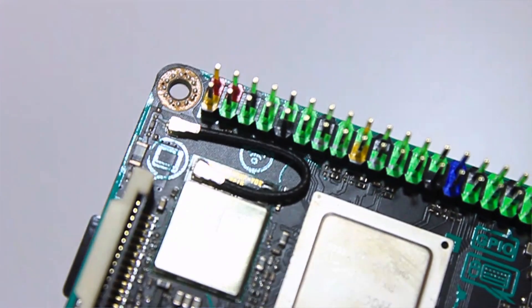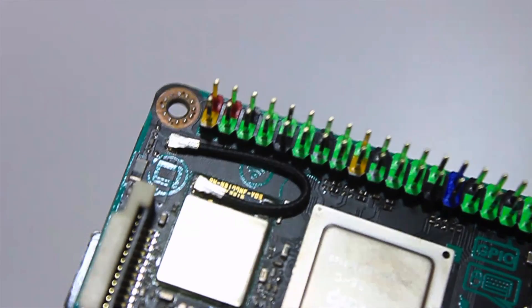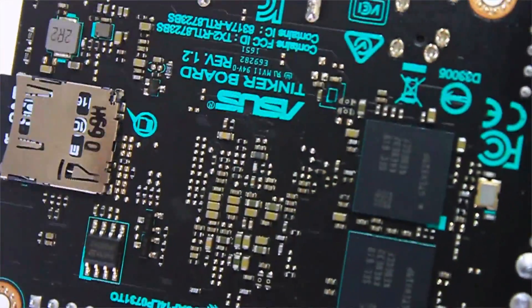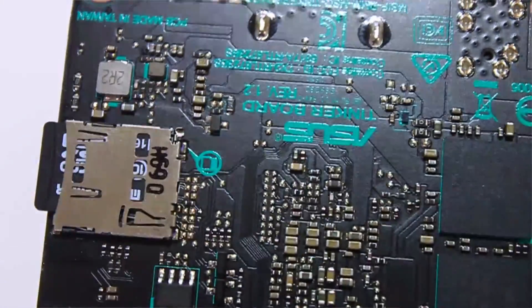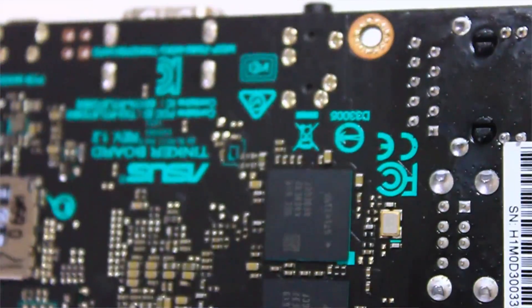Another thing is that they added an external Wi-Fi antenna connector so you could plug in your own to get better range. This uses a quad-core 1.8GHz ARM A17 processor with 2GB of DDR3 RAM dual channel, and it's also using SDIO 3.0 compared to 2.0 on Raspberry Pis, so you should be able to get faster reads on specific cards.